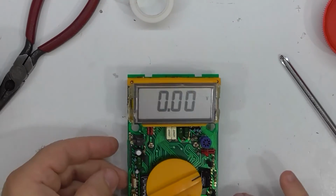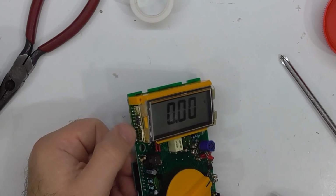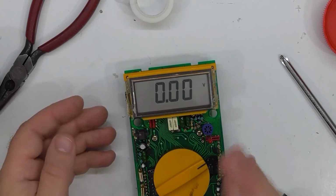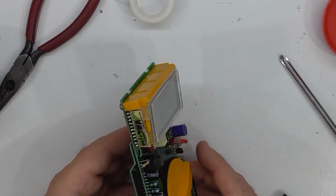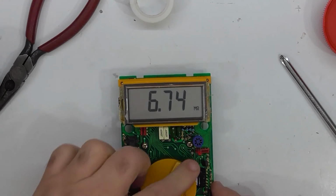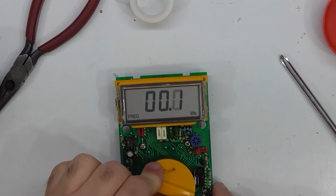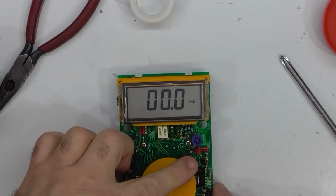Okay, so I've moved it over a little bit more, resoldered these connections here just to remove any stress on the solder joints. It is hard up against the module, but hitting each of those joints successively should relieve the stress on those, and that's pretty much fixed it. So it was just a mechanical issue. Now the module's fixed with the right signals. It's all working fine. The right indicators are coming up, decimal points.